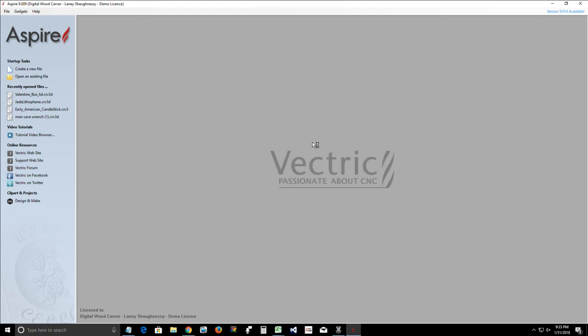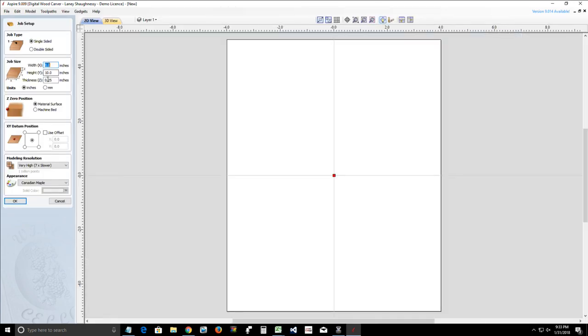Yeah, Bob, Vectric does have a good video on lithophanes. I'm going to create a new file. This is going to be an 8x10 project, a quarter inch thick to match my Corian or my cast acrylic or my white plastic or what have you. You want to use a semi-translucent material that is not fully translucent, but semi-translucent. So we're going to click OK on this.